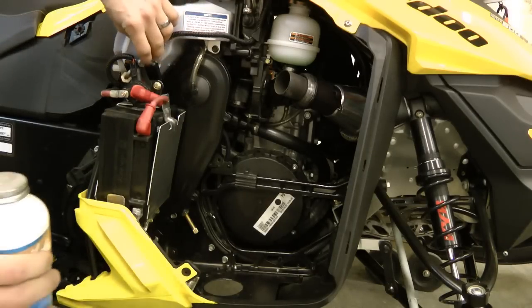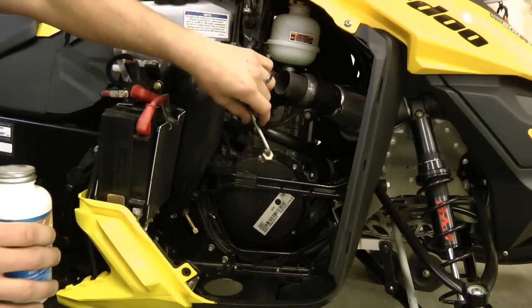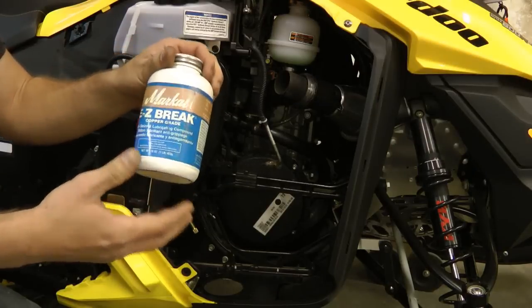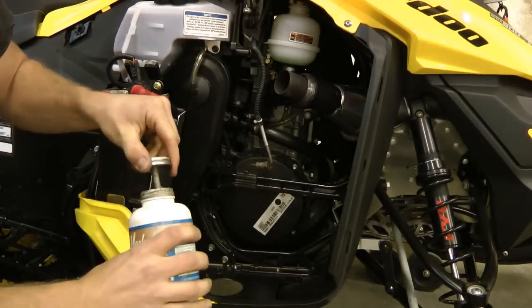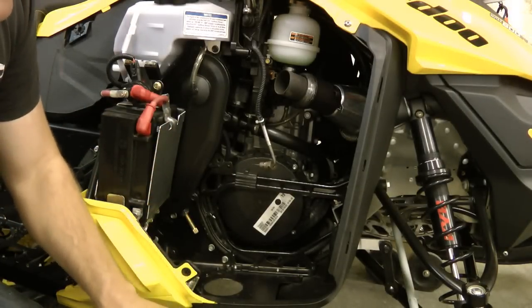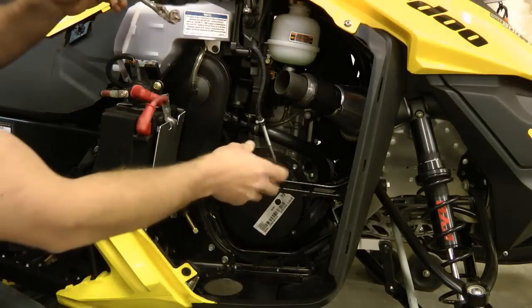Something that you will want to do is take your heat probe and put some anti-seize on it. There are a couple of different brands — we use this one. All you do is take the anti-seize and dab a little bit on the threads. It allows the threads to stay tight and prevents them from galling.